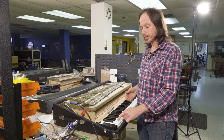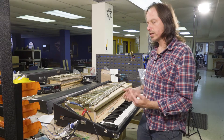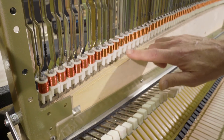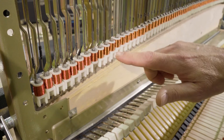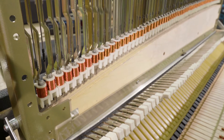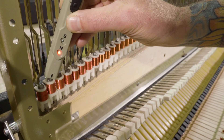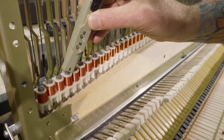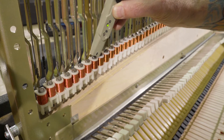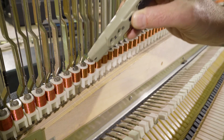Right there is where the fundamental drops out. If you listen again, it's completely gone and that's exactly where the split happens. So let's lift up the harp and look inside. Here we are — if you notice the bobbins are all the same, it's the color of the winding that is a telltale — one, two, three, four, five, six, seven, and actually eight, and that's a replacement pickup that we put in utilizing the original bracket. Let's go with our tester and you'll see that's a north-facing pole — again, this is indicative of a 1970 era — and now we switch to south-facing and the rest of them on the piano are all south-facing, and that's where our problem is.